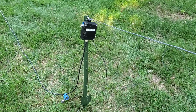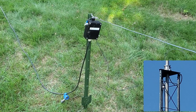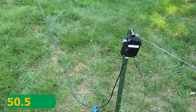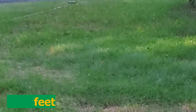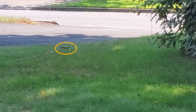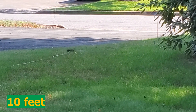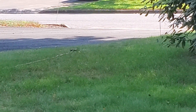Here we have the matchbox on a short three-foot or so fence post. My long coax is about 35 to 40 feet — I'll post an exact measurement. And you can just see in the distance there the choke and then a short length of about seven feet of coax. So we're going to be heading down there, hooking up the Rig Expert and getting quick multi-band SWR readings.